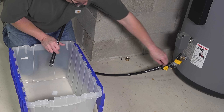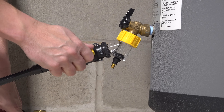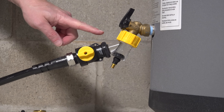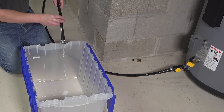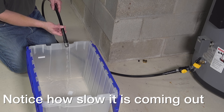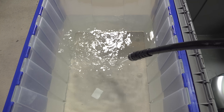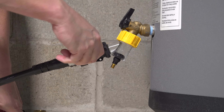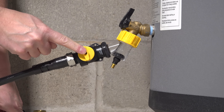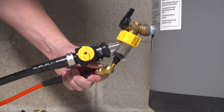I'm going to open the valve on my water heater. At this point nothing's coming out because the valve on the Sediment Buster is still closed. Now I'm going to crack it open and see what happens. As the water was draining, I noticed one thing — it is crystal clear. This tank doesn't even look like it needs to be cleaned, which was concerning me because I figured, how am I going to test this thing out? The next move is closing the valve on the Sediment Buster and giving it a couple little bursts of air into the bottom.